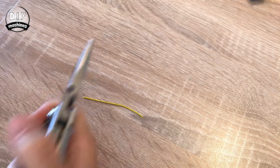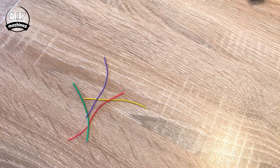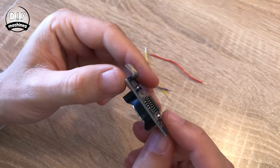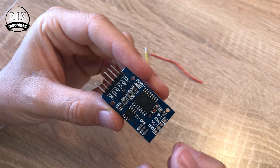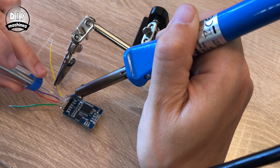To connect the RTC, we're going to need four wires. They don't need to be as long as the ones we had earlier, so about six centimetres should be absolutely fine. On our RTC there are six connections on the opposite side to the battery. SCL, SDA, VCC and GND are the four we'll be using. Solder a wire to each of these four connections and we'll then get on and connect it to our Arduino in the next steps.